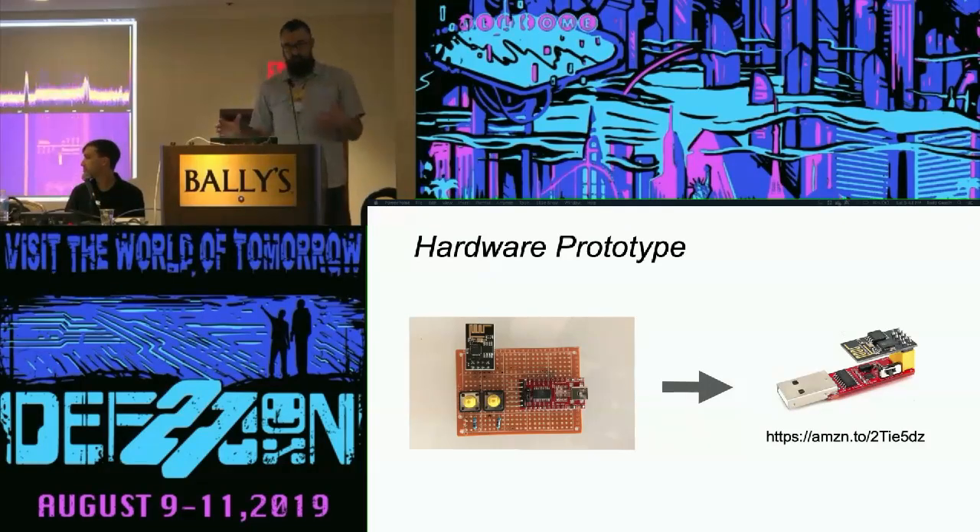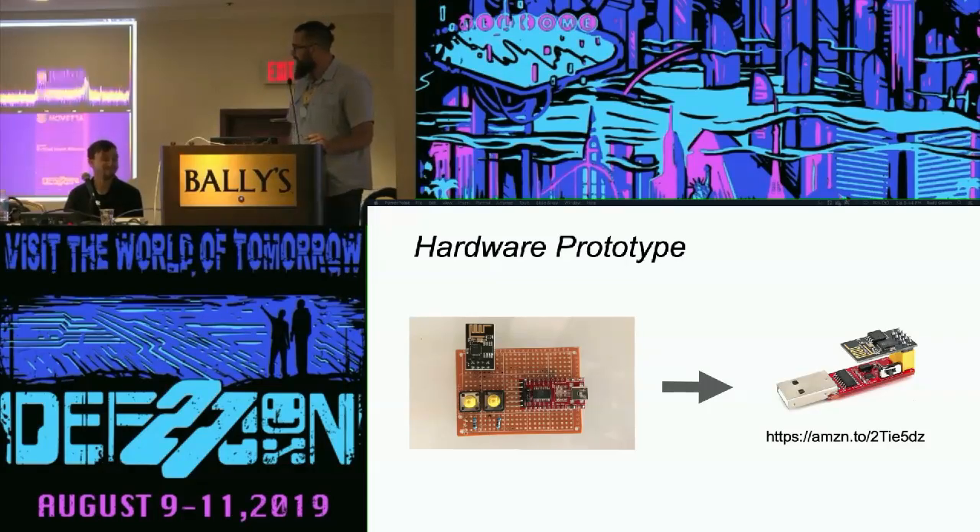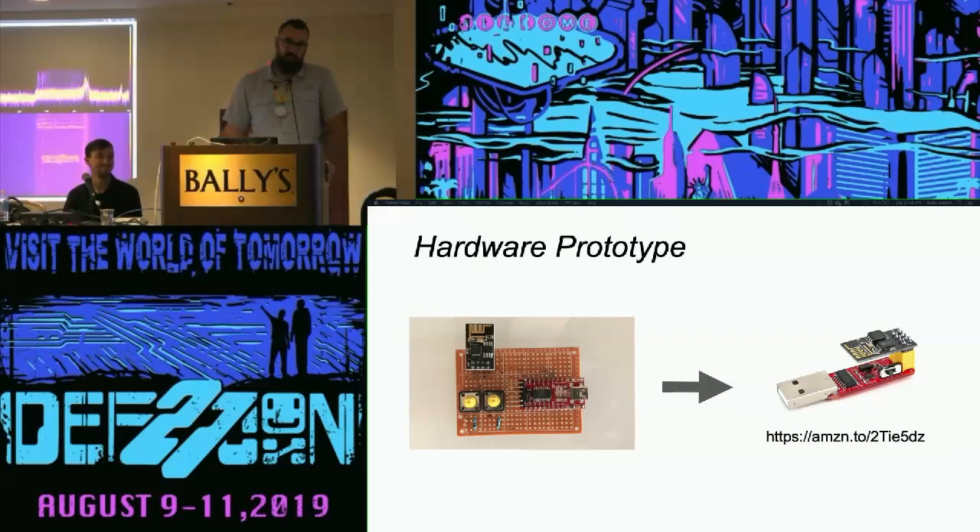After we were done developing, we had to go back to the requirement of making our sensor nodes concealable — because you all would be thieving. We needed to make sure you couldn't find them, or if you did see them, you didn't think they were anything valuable. We even got to the point of talking about putting Cyrillic characters inside our code in case anybody dumped the firmware, so they'd think it was coming from somewhere in Eastern Europe. The NSA actually has their own OUI — that's the first three bytes of the MAC address for your chip — and we thought about setting our MAC address to the NSA's OUI, but Minnie talked some sense into me.